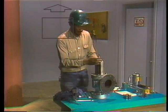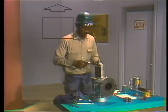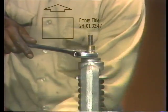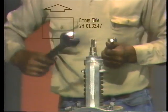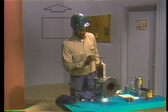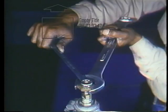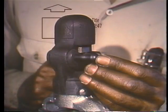He then tightens the compression screw lock nut against the yoke — the lock nut prevents the screw from moving during normal valve operation. Notice that when tightening the lock nut, he uses a second wrench to hold the compression screw in place so the screw doesn't move even a partial turn. When the lock nut is secure, he reassembles the hand lifting assembly and installs the protective cap. He lubricates the threads at the top of the spindle, turns the lifting nut into place, then installs and tightens the lock nut. Next come the protective cap, the hand lifting lever, and the pivot pin that holds the lever in place and enables it to move up and down.